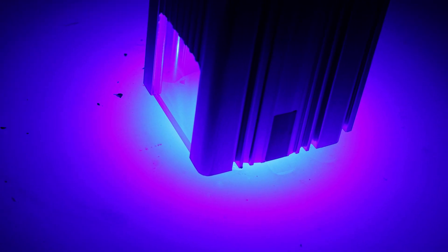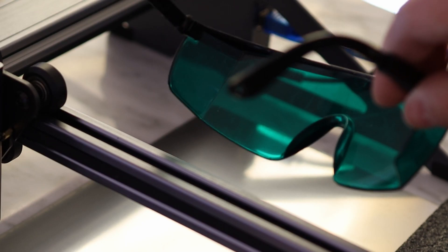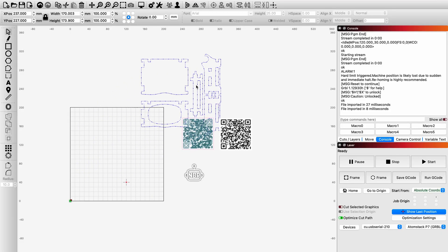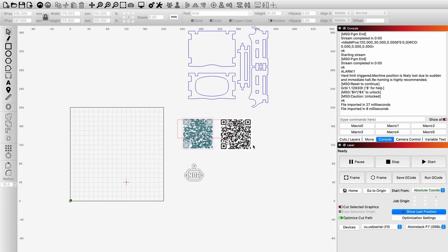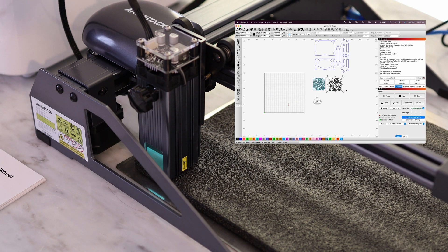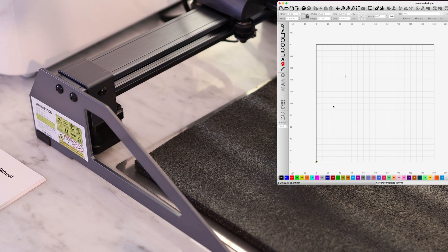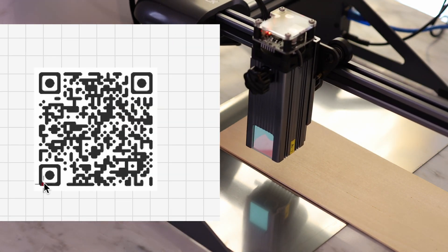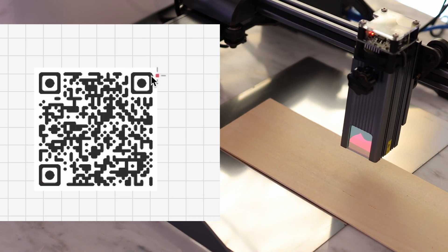The next step is plugging it into my computer and programming it to cut out or engrave some different objects. I highly recommend you get some laser safety glasses — the Atomstack kit doesn't come with safety glasses so you'll need to buy these separately. I installed some software called Lightburn and it's basically a slicer for laser cutters. It allows you to upload different types of files or draw something in the design space and cut it out with the laser. Setup was super simple — I just told it to add a new machine and it automatically detected the laser cutter and set up the whole configuration pretty much by itself. I also created some QR codes that I can print onto things. I can move the laser cutter around just by clicking different places on the workspace.